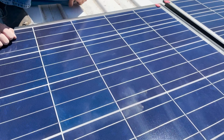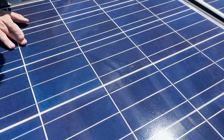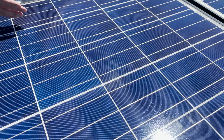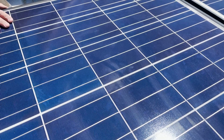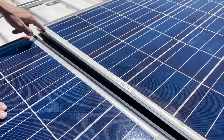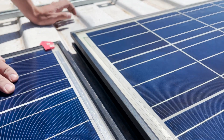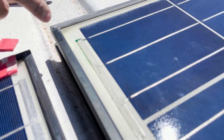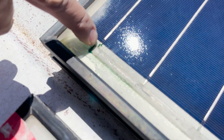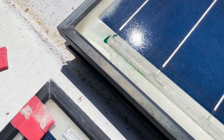That could really cause an issue — it could cause these panels to have a short circuit, which can lead to a fire. There's some marking right here, but that was actually just on the surface of the glass. Used panels are cool and all, but when you realize we have two panels at $75 a piece — so call it $150 — and they're no good. Look up here at these traces: there are some green marks where things are totally rotted out. It's absolutely no good. I can't use these panels in my install because that connection failing could easily lead to a fire.